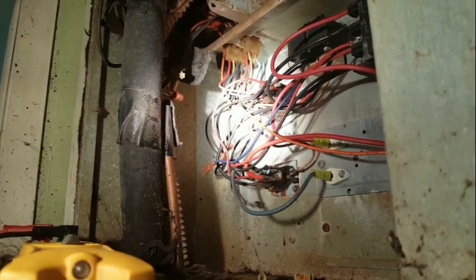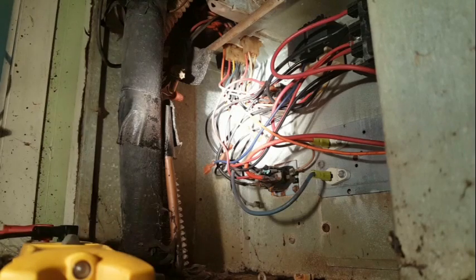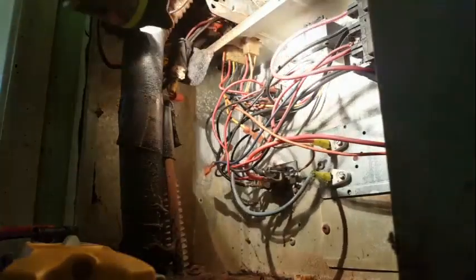All the controls. Got this new piece of plywood sitting here, which was evidently probably where the floor rotted out, where it flooded. Per the norm. Looks like we have the thermostat, high voltage. We got a high voltage on the transformer, we got a low voltage. We got red. Common is yellow, it looks like. I'm going to make sure that's right. That might be black down there. Three wires and three wires on top.